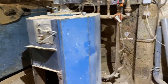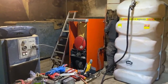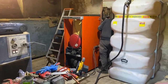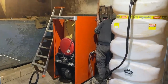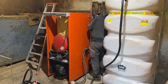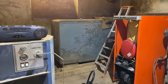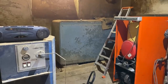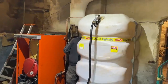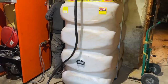Boiler installed. We've just been around and bled the rads — 19 of them, 19 flipping radiators — and that's excluding the top floor. We're just now priming the system and hopefully shortly we'll have some warmth. The oil tank that was in here — which is useless, and what we're eventually going to take out — it turns out a quarter of it was filled up with oil. So we've siphoned it over. Looks like a fuel pump has been popped in, which has probably filled a third of this tank up with the oil. So touch wood, we're good to go.